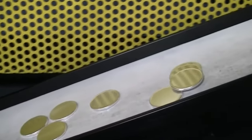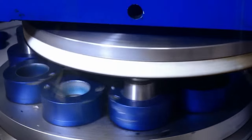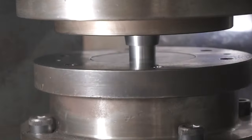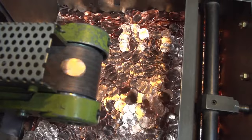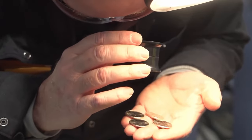The perfect blanks are carried by conveyor belt to the coining press, where they are stamped with designs and inscriptions. A steel collar is inserted into the press around one of the dies. The die for the reverse side is loaded into the upper arm of the press. Hundreds of tons of air pressure push the blank into the collar. At the same time, the overhead die is forced down into the collar and onto the blank, causing the impressions to form on both sides.